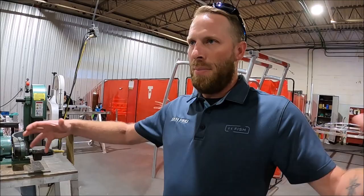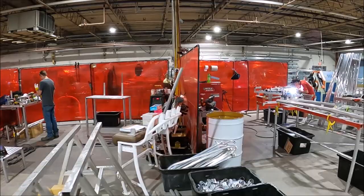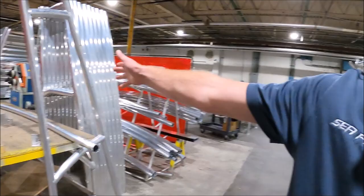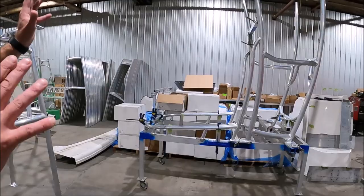Some jigs are for sub-assembly, so one guy will build one part of it — maybe two or three pieces — and then they all come together with one guy who adds it all together and welds it all out in one spot. Once everything's welded, it'll move out to the floor. Like here — he's just tacking all these legs together, and they might go to another guy with a similar fixture to weld it all together.